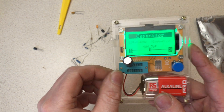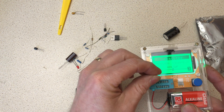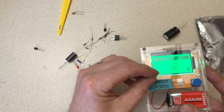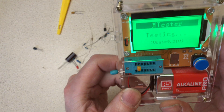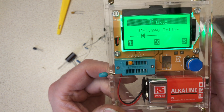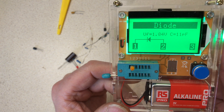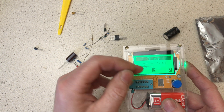It tells you the ESR as well, which is handy — 484 microfarads, and it's a 470 on the can, so for a cap I'm happy with that, that's close enough. For an LED — one thing this doesn't identify, and I'm not sure how it would actually be able to — it'll test it but it'll only come up as a diode. It does identify it and tells you which is anode and cathode, though some of these are a little bit harder to identify.